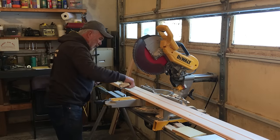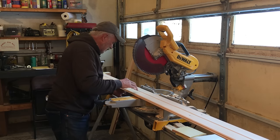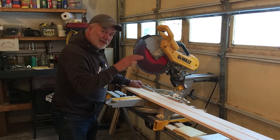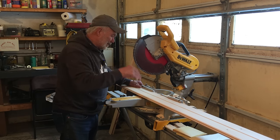For the door I'll need five of these pieces, then I'll rip them to get it all centered — 56 even. I'm going to make the door as one piece, trim it out, and then I'll cut it to make it a Dutch door.